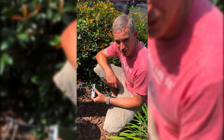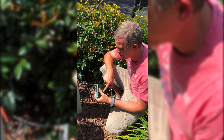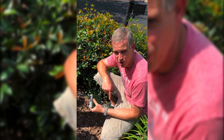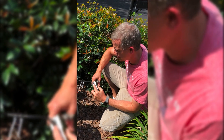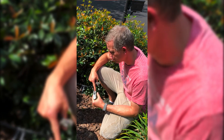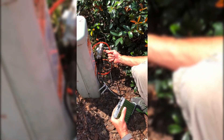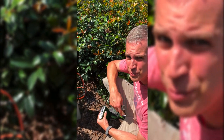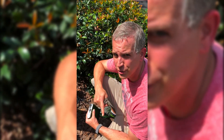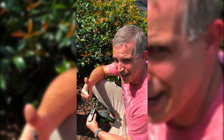Last thing: once you've found your impairment, don't forget to come back and get your pressure test meter. Obviously you'll be doing that when you're replacing your drop, but turn off your pressure test meter. Never inject signal back into your plant. You never want to connect your pressure test meter directly to the tap — you'll be injecting very high level signals into your plant and that will knock other subscribers offline. So that is an important tip to remember. We are done at this location. We will run a new drop and we'll get this subscriber back online and happy.